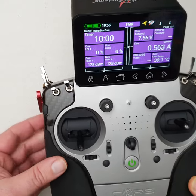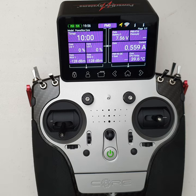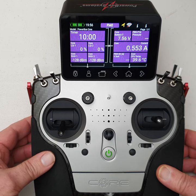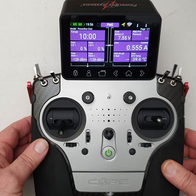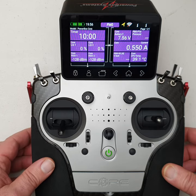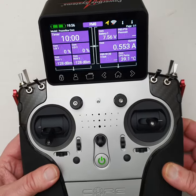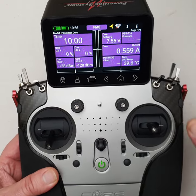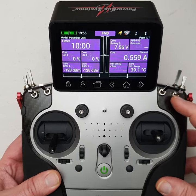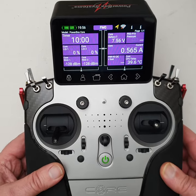All these switches are pretty much user-changeable. You can actually purchase locking switches — the pull-to-lock type, which are commonly seen with jet turbine pilots. I just find the standard switches fine for my use. I find the locking switch annoying because if I want to flick it in an emergency, you have to physically pull the switch up and move it to position, whereas a toggle switch is easier to flick on or off.